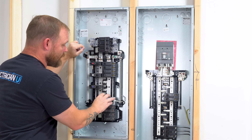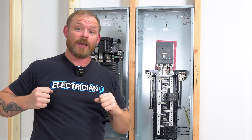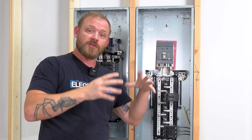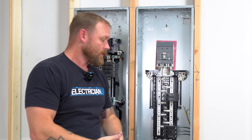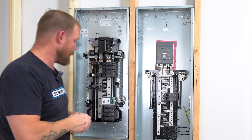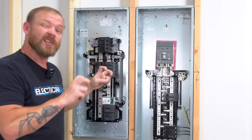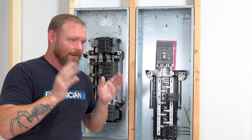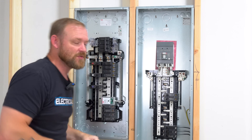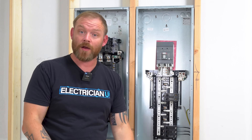What's going to happen with a surge protector is it's going to take any kind of excess energy that comes into the system, dampen it, and dump that excess energy to earth. There's a little mechanism inside that allows all of that energy to be shunted. Shunting is like something supposed to be going this way, but you're redirecting it that way — choosing to put it into a different path, and usually that path is ground.